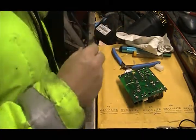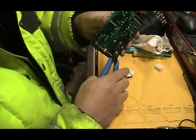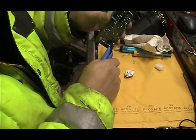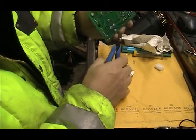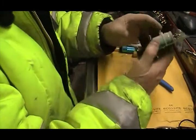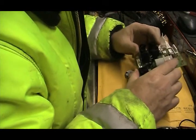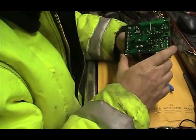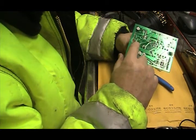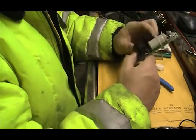They sent me a little cutter. I need to leave just a little bit, so instead of cutting it exactly flush, I'll pull it back just a little bit and then cut it, in case I need to do another repair - I've got a little bit left. Then you always check your work to make sure no solder is falling down in here, and make sure there's no solder bridging a gap somewhere. These are all pretty tight. Everything's good. We'll try that.